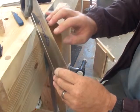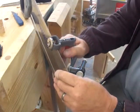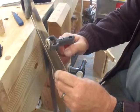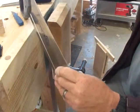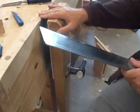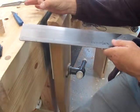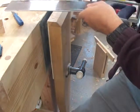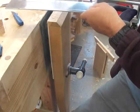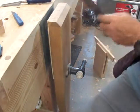And you want to use a light touch on anything you do with this set. You come along, you're just squeezing it and giving it a little bit of tweak. If you overdo a set, you can put a hammer in the vise with the hammering face up, set it on there like a little anvil, and take another hammer and tap some of the set back out. So these are things you can do.